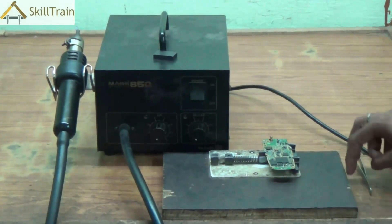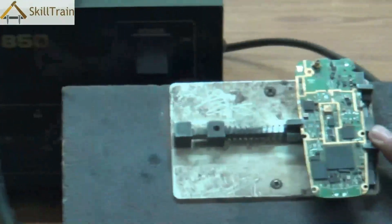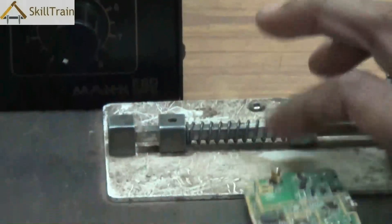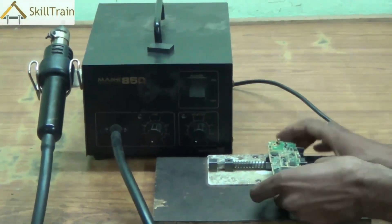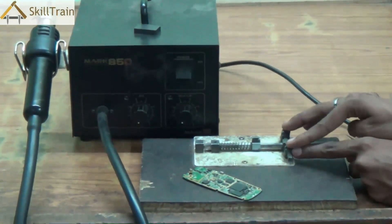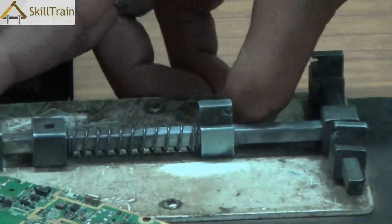You must also remember that the PCB has to be placed on a stand while you are working with the SMD. The stand holds the PCB tightly in its position and will not allow it to move while you are working. If the PCB is left loose, movement can result in misalignment of components. The PCB stand has a fixed part on one end and a lever with a spring on the other end that can be pushed back and forth depending on the size of the PCB, ensuring it is held tightly.